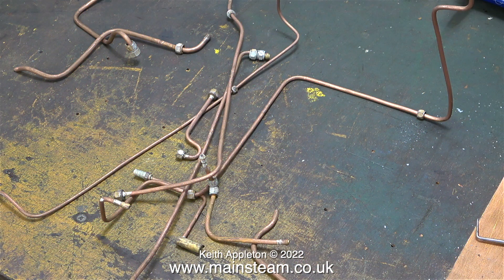Now's the bit I'm not looking forward to, and I do have a bit of a problem. You live and learn in this job. As I mentioned earlier, these were in the acid bath for a couple of days and came out quite clean. I got rid of all the acid from the components using a hosepipe. But then I left the piping in the outer part of the workshop for a couple of months and something has happened. The copper piping has oxidized slightly, but the brass union nuts are a bit of a mess — they look like they're de-zincifying.